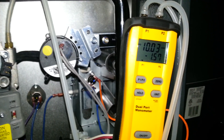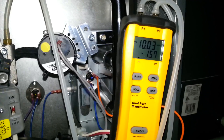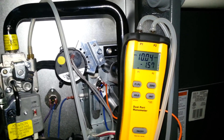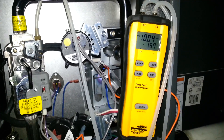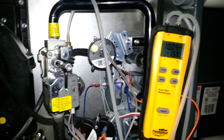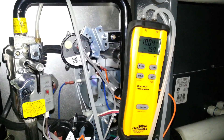The dual port manometer seems to be reading really well and responds quickly. It can also do static pressure, but it was really important to measure the gas pressure at this house because this is a new construction house using liquid propane on a high efficiency system. You want everything to be just right — for safety reasons and for efficiency reasons. Our flames look great, our pressure looks great. This is a great furnace and a great install.